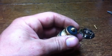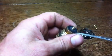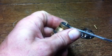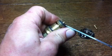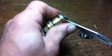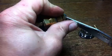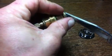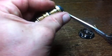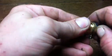Okay, so let's have a look at this. You can obviously take your washer off and take it out. It just unscrews like that, and then you can pick the washer out. Now, if you're refurbing one of these, if it's dripping or such like, what you want to do is change the washer. Easily available from almost anywhere. Or the other trick is to turn the washer over. Obviously, you're inspecting the washer for basically degradation or splits, cracks, etc. Again, you'll know if it's bad because it'll actually fall apart in your fingers.